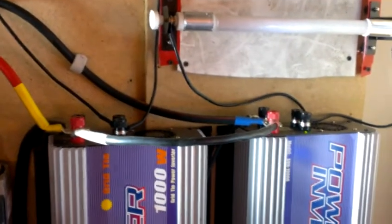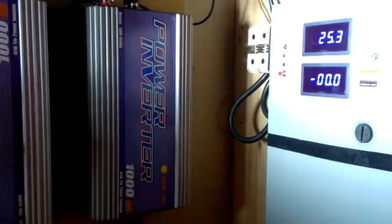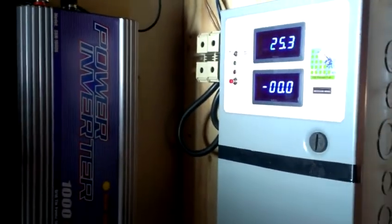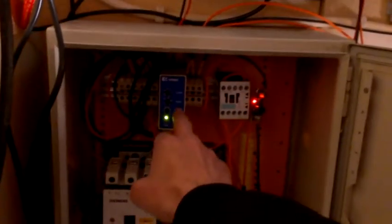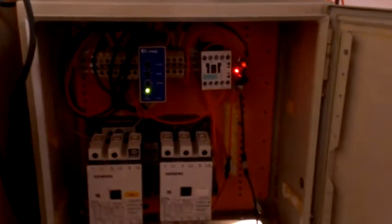They are spinning. So this is a very safe way to run your wind turbine. And if the voltage is getting too high — about 28.5V I think — then this will kick in. I have this voltage guard here. This contactor will kick in. This will drive my batteries with the 150W.